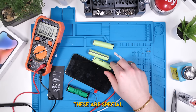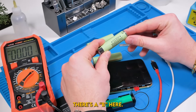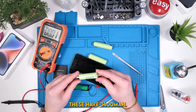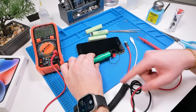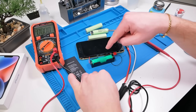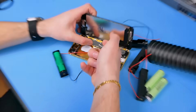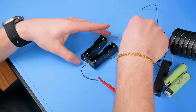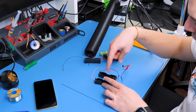And that's why we bought these — special batteries made by Panasonic. They are 18650 batteries, but you'll notice there's a 'B' here, because instead of 3,000 milliamp hours like normal 18650 batteries, these have 3,400 milliamp hours. The next step is to add not one battery but three batteries to this BMS board. We have to chain a few more battery holders in parallel to this battery, and that should be enough power for the phone to stay on. We'll disconnect the BMS from the iPhone, remove the 18650 battery, chain the battery holders, and solder them down at each end.